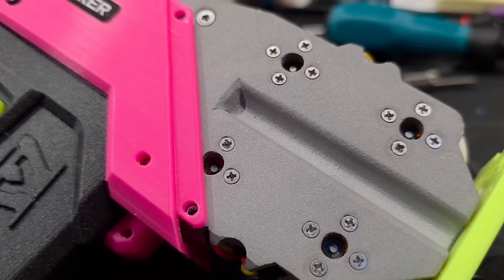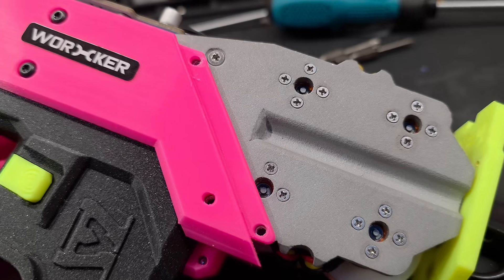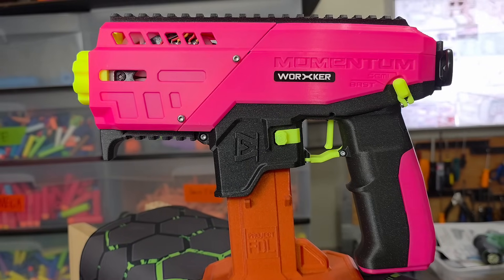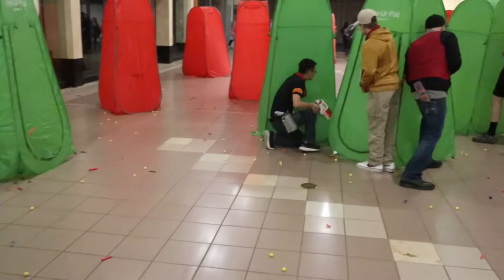When I received my parts I did have to tap the actual holes — that was my fault for not specifying threaded holes. The file set was also designed for plastic thread-forming screws, which work great for 3D printed parts attaching to themselves, but not so great when attaching plastic parts to aluminum. After tapping those out, the build turned out great. The blaster feels amazing — sleek, with a nice weight to it — and when the solenoid fires it gives a satisfying haptic feedback. I now find myself using this blaster in both low and high FPS games; it's kind of become my go-to.